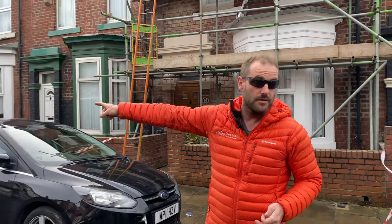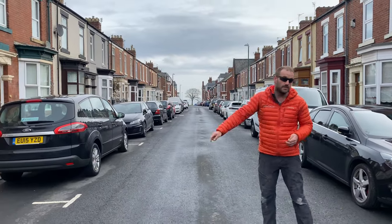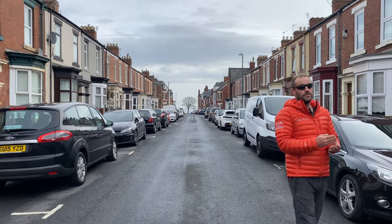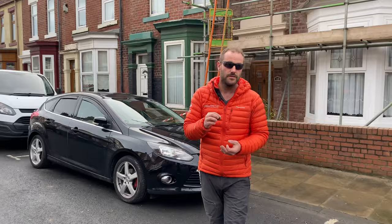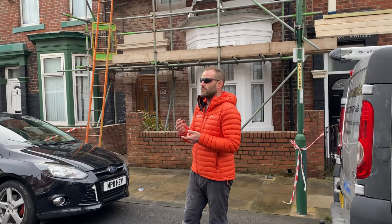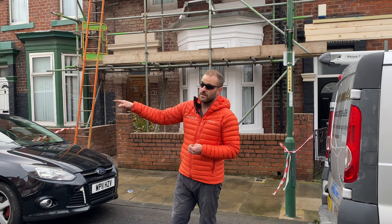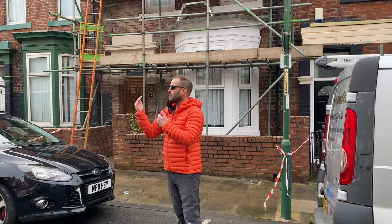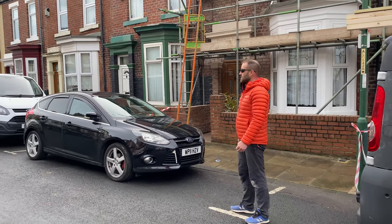this street, can you see? See, that is the sea down there. So the number that you see after NHL is the strength of the mortar, more resilient to the weather. And because the beach is just down there, we get a lot of north wind, it just hammers down these streets, and that's why the pointing is so bad on these properties.